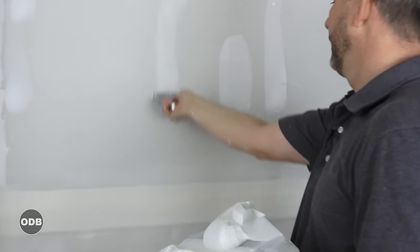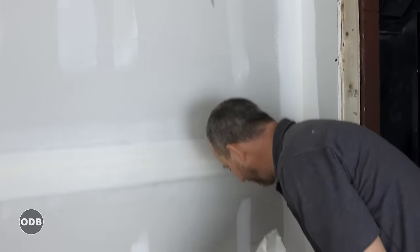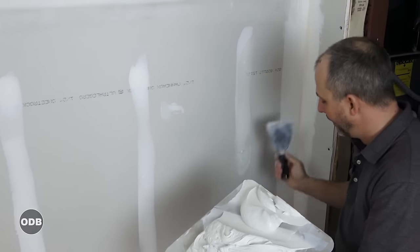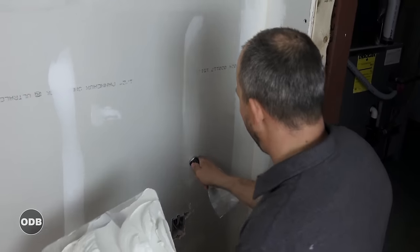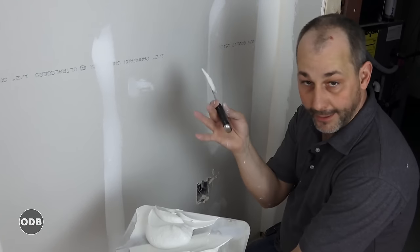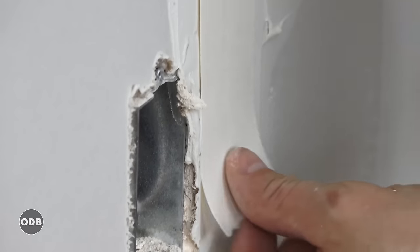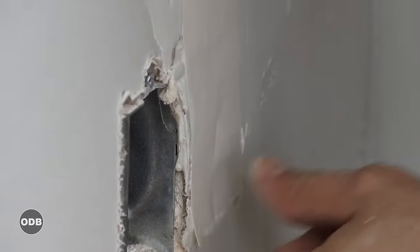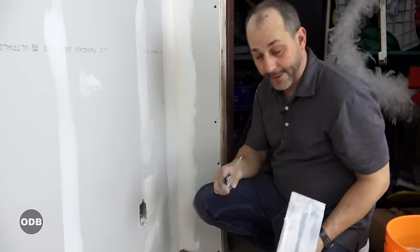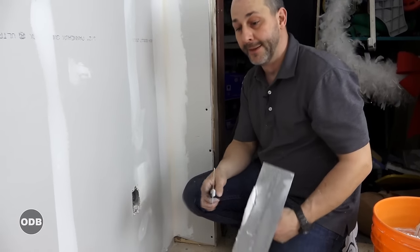Second opportunity — hit the screw holes. Never let an opportunity go by to hit the screw holes; it gives you a chance to make sure they're all sunk and the head isn't sticking out. We have a ridge here — need to investigate. Somewhere during construction, that screw hole missed the mark and it's getting filled. When that happens, don't just cover it up with mud and sand it bump-smooth. Dent it with your handle, fill that hole with mud. Same with this — it's a bit of a mess. Add mud, add paper, clean it out. This patch is back to first coat, and that's ultimately the problem. The way we fix this: tomorrow when it's dry, we'll hit this with some 45-minute mud and then do a finish coat over top, so the whole job finishes together.